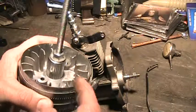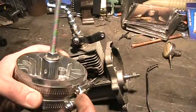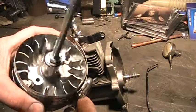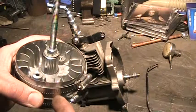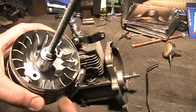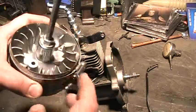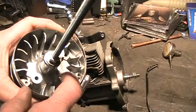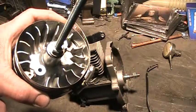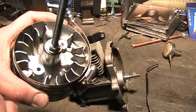I made a form out of sheet metal. I'm going to blacken it with my acetylene torch, the same as the socket I'm using as a core. Blackening it with the torch should help me release the socket after pouring. I don't see a problem with the sheet metal outside, but I'll blacken that too. It'll also make it a lot safer because the edges are pretty sharp — when you're trying to start the motor you can catch your fingers.